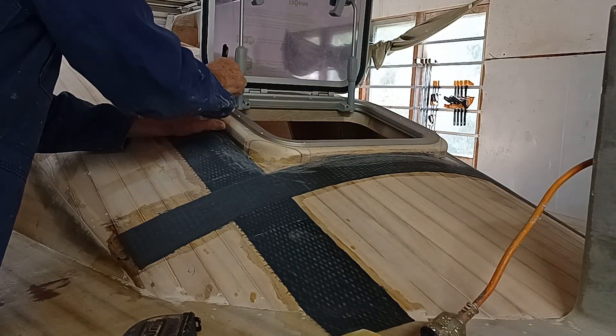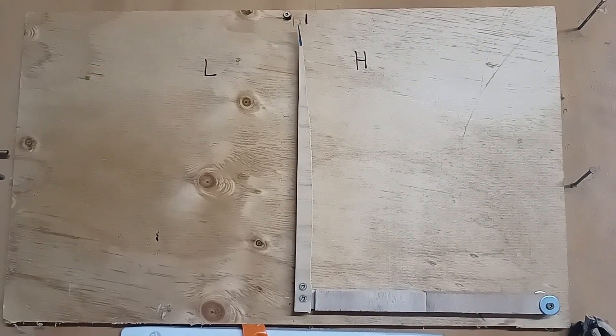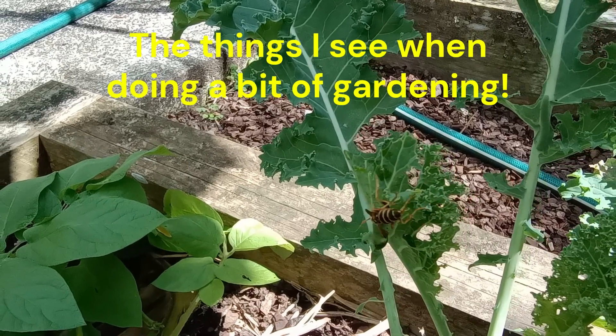And the next one, which is unstabilized, there's quite a significant gap — about three millimetres, one eighth of an inch. So if I'm going to do that with the same method, I'll have to cover the deck, dehumidify it with some heat and air, put the uni over the top, and then I can remove the deck frames and do underneath. It's midday and it feels quite humid still — I've just been mowing the lawns. You can see it's certainly drying out. There's a wasp here getting a caterpillar — amazing.